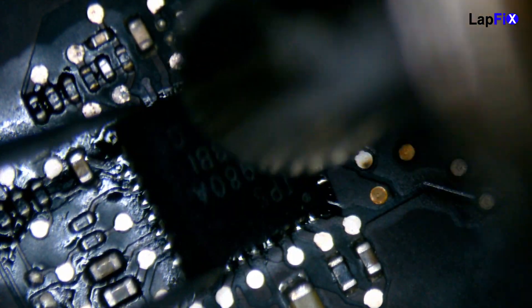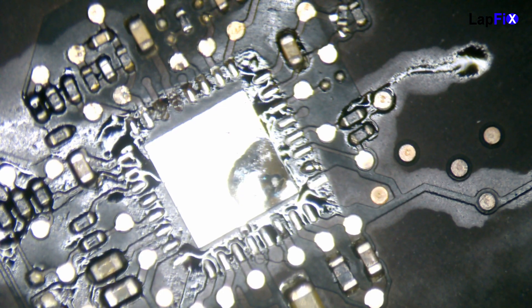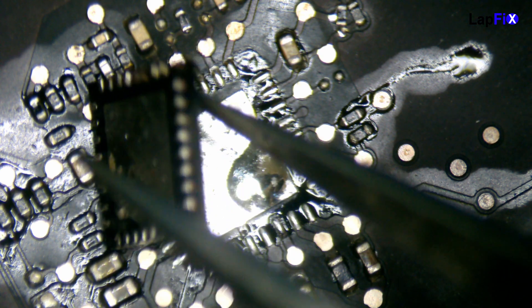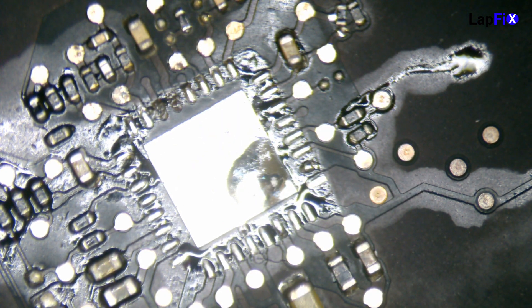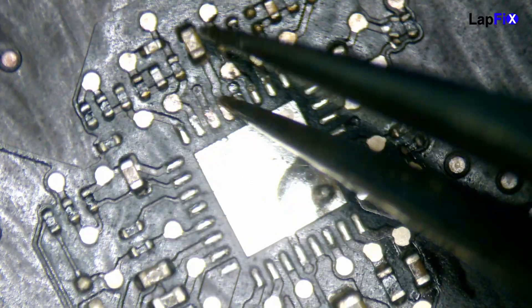This has been removed and you can see the cause of the issue. If you look at the top of those pins, you can see two of them making contact with the trace — especially one making contact with that capacitor up there — it has been blocked and completely damaged. We want to make sure not only that this gets replaced but that the pins on the board will make a nice contact. In a worst case we'd have to make a wire connecting to this, but it looks like we can just clean it off and now it's exposed again just like the other ones and will make a nice contact.